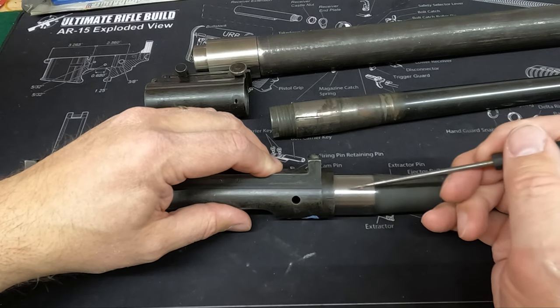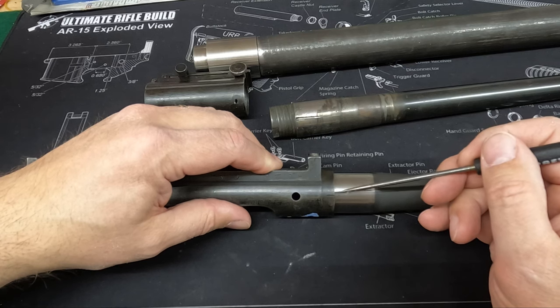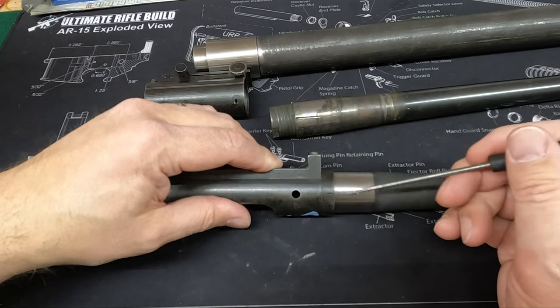I told a toolmaker, a friend of mine who did this on the lathe, to give me a 16th of an inch, thinking that would be plenty. Well, that was too little, to be honest. Probably should have been at least an eighth, maybe 3/16. So if you do that, be careful not to go too far. But if you do, you can do what I did.